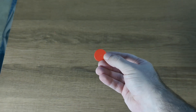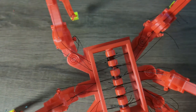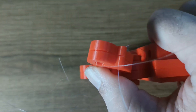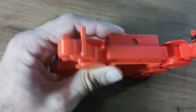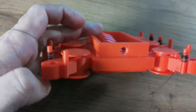Caps make sure the legs don't flex under gravity. This part of the ant is called the coxa — it is the part responsible for swiveling the legs back and forth. I use spring flexors for all my joints, but the part that mimics the coxa was bending up too much. The cap stopped that upward bend. This was a quick fix, but I hate it. Even though they were stopping the bending, they kept popping off. I have an entire redesign that will make it so I don't have to use these caps anymore.